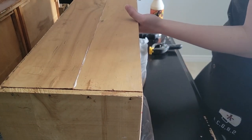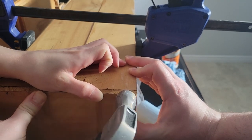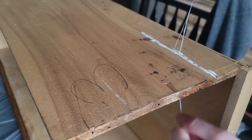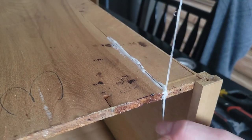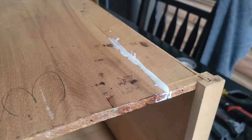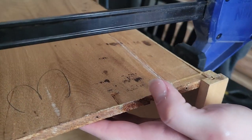Because of this awkward angle, I did have to come in and nail the side so that the board wasn't popping up on me. Some of the other drawers just had a bit of a crack and I didn't want to completely break them, so I'm just using some dental floss to get the glue in there. I did have to add a little bit more because when you clamp it up, you really want to have that squeeze-out to make sure the joint is fully loaded.